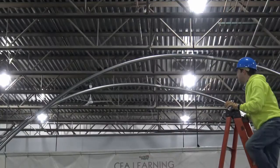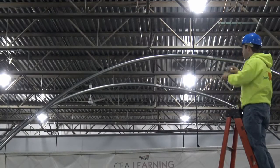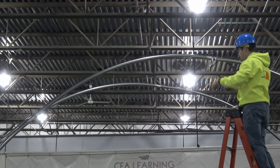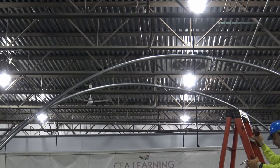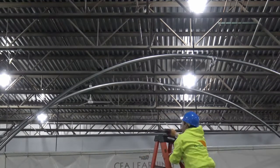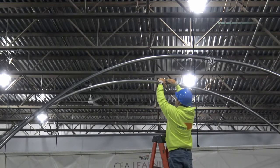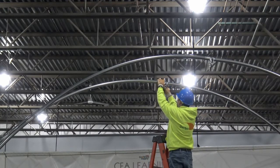Install the clamps you will use to secure the purlins. Some require installation at the step where the swage pieces of pipe that form the rafter slip together. These seen here can be installed after and are normally for interior pipe rafters. Loosen bolts to allow the purlins to slip through as required.